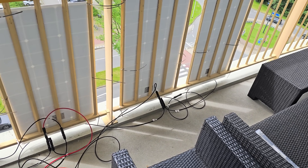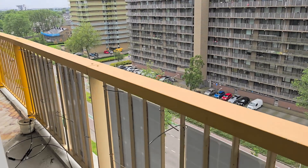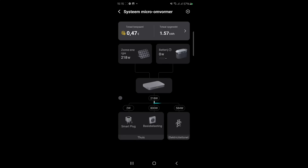I'll keep it just flat but the solar panels will still catch the light. We've got a little bit of sun now — it's about 220 watt right now, so that's one-fourth of the 800. Obviously the wattage will be a lot higher when it's fully sunny outside and the sun is more towards the solar panels, which is from around nine in the morning till around three o'clock.